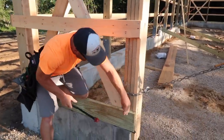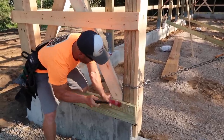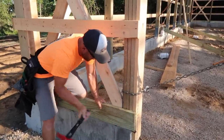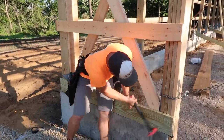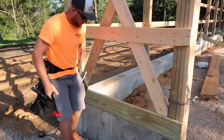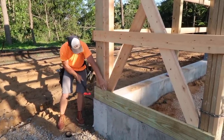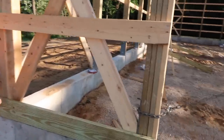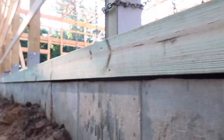It's always nice to make sure you angle a nail down — that will suck it down nice and tight. I just want to make sure I touched on that topic: how the grade board is sealed down to the wall. It works really well. Let's get on to the next part, which is the main part of this video.